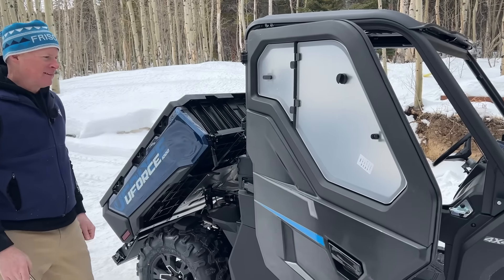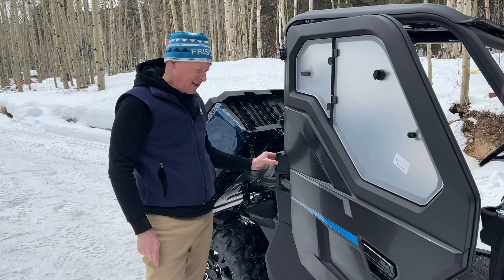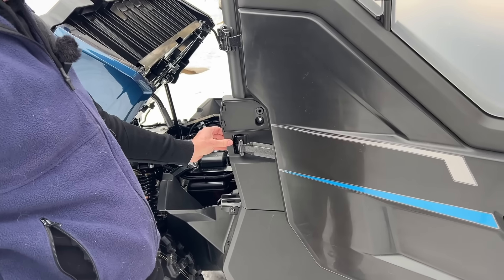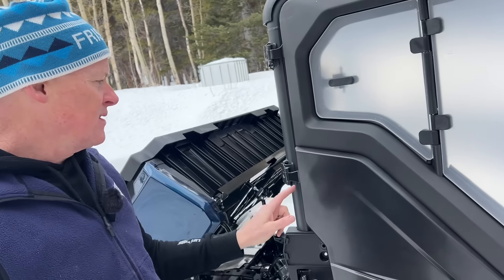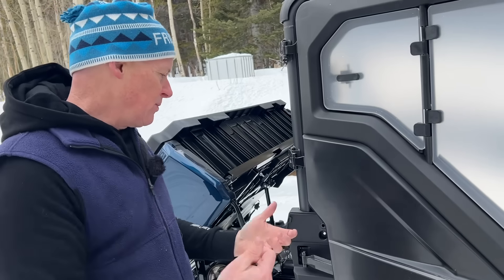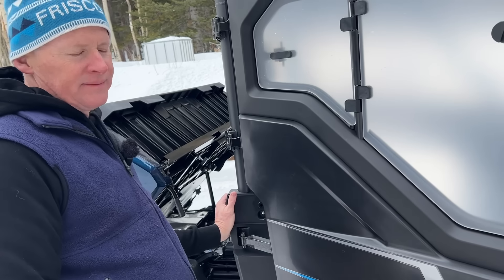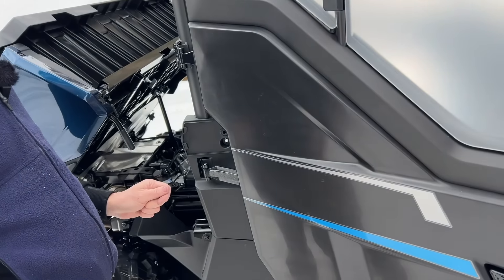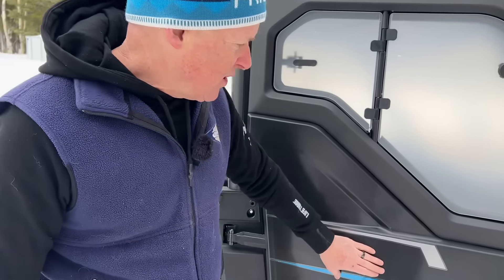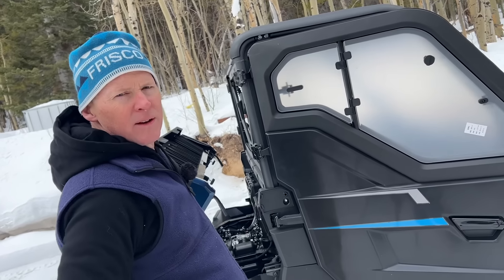So there's one door on — here's what people should know about installing it. You have to slide this plastic molding onto the door first. All these screws on the inside are loose — they're self-centering — so you can adjust the door. I tightened these up so I could open the door, put these screws on, close it, and then put this back on. It's a little tricky. You thread through the covering, thread through the hinge, because once this molding is in place you can't get to the screws. I did shim the door a little bit with a piece of wood on the bottom to help with alignment — just like putting in a regular door on a house or a shed.